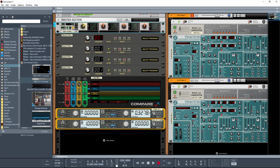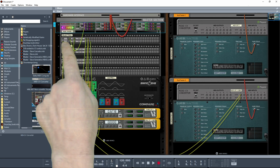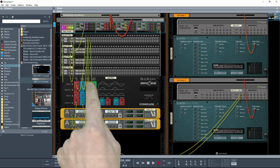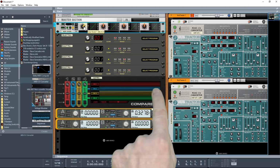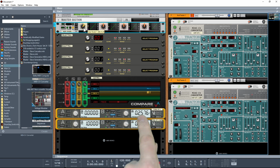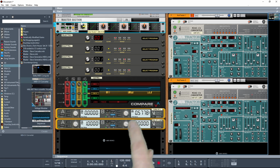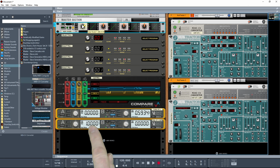Right, a very quick amendment. One of the tests I didn't actually do was have a signal coming in, nothing plugged into that one, and then outputs to both ports, and these happen to be going channel 2 and 3. The main reason I'm doing this amendment is because it's an interesting result I've just seen, and I thought I'd quickly film this as a show and tell. So as I change the value, it's going to affect this as expected. You can see it affecting this. But interestingly, every time I'm changing that value and it's picking up that change, it's re-triggering this port here. This is dropping back to 0 and a 1.